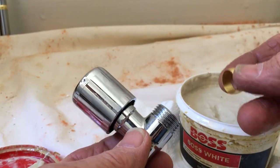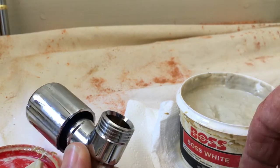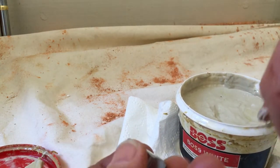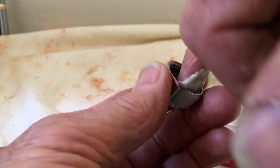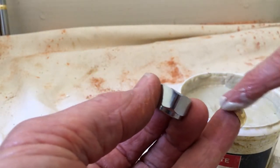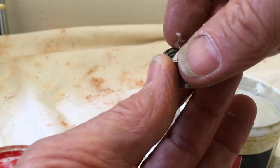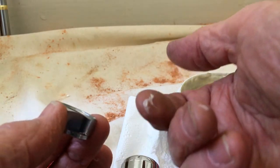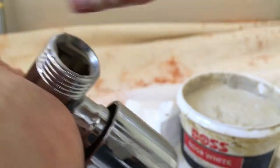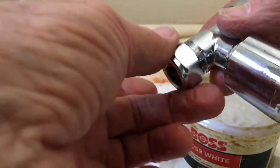Some people like to go without any boss white on their brass olives. Personally, I don't think it does any harm to have a tiny smear of boss white, so that's what we're going to do — just a tiny smear right on that shoulder. Leave a comment if you want to tell me I'm doing it wrong, because even though I'm an ancient old geezer I'm still happy to get new information. I am a DIYer after all, not an expert with 30 years' knowledge.